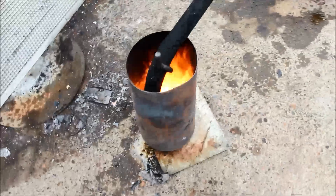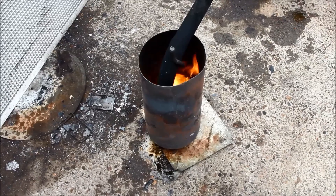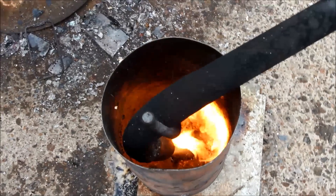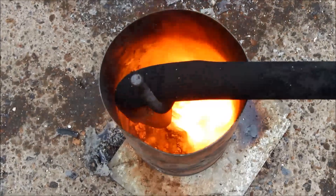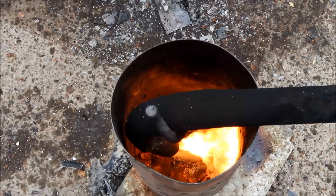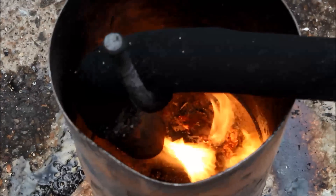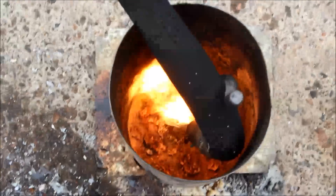As you can see it's not a small extinguisher bottle I've got there — you can see in other videos where it's pumping out flames easily three feet high and probably doing at least 150 kilowatts. I have no way of measuring it but I would say this is well under one liter an hour. I started off with a near-empty tank and I've still got a near-empty tank. With small outputs it's amazing how economical they can be. Normally I've got my eye on the fuel tank to see when it's going to run out — now I'm just looking at it to see if it's ever going to run out. This isn't a lot of heat, but when people talk about low outputs, that just goes to show you what can actually be achieved.